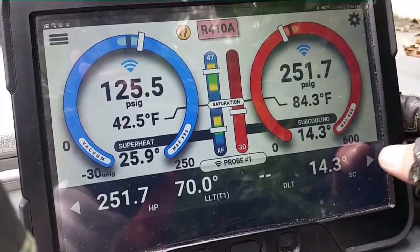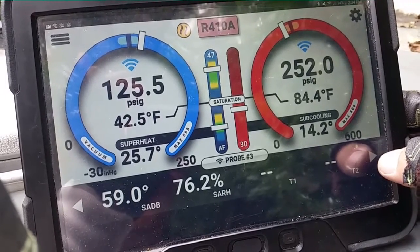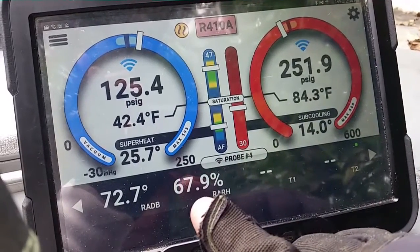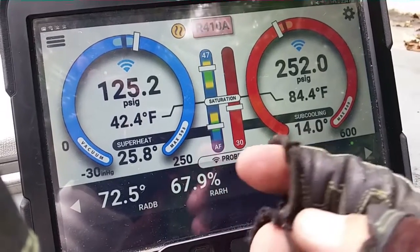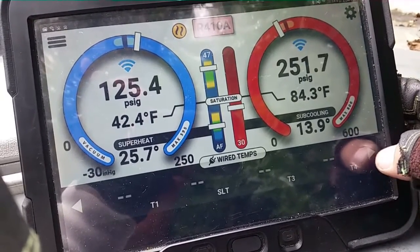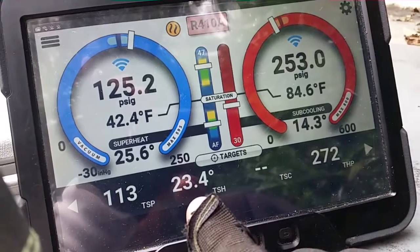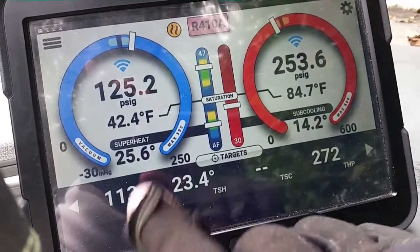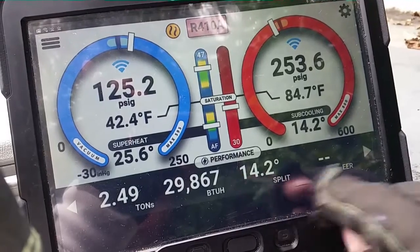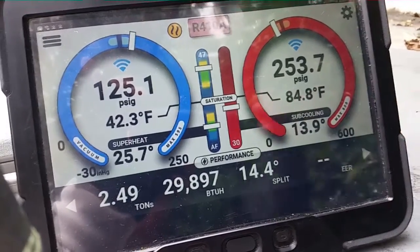Let's go through the line here - first probe, second probe, and then we've got 25-degree superheat. It's 69 outside, a little warmer than I thought. Supply air 59, 76% relative humidity - actually 67.9% relative humidity. So we have a relatively low split; should be 13-14 degrees. Target head pressure 272. Target superheat 23.4 - we're pretty close there. Target suction pressure, we're a little bit higher than that. Subcooling 14.2, pretty good. Pretty close - we'll see how high it gets since we don't have super airflow.